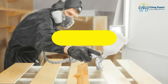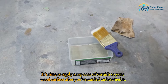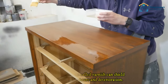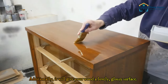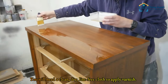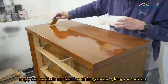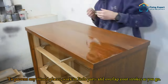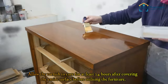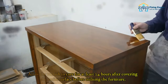Step four: apply a top coat of varnish. After you've sanded and stained the wood surface, it's time to apply a top coat of varnish. A transparent sealant, varnish can shield your wood from moisture and deterioration and will give your wood a lovely glossy surface. Use a clean, dry, lint-free cloth and apply the varnish in the direction of the grain using long, even strokes. Work in small sections and overlap your strokes. Allow the varnish to cure for at least 24 hours before using the furniture.